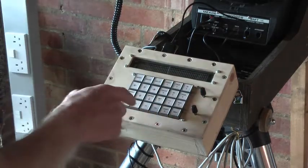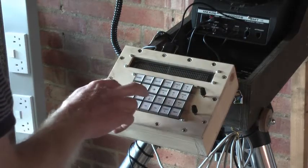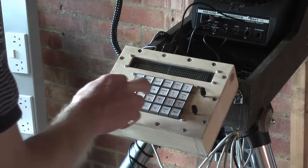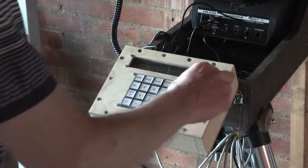We've also used the FPGA on the Pixi to provide a couple of rotary encoders. The rotary encoders replace or add to the menu up-down keys on the keypad, so instead of having to press the menu keys to go up and down through the menus, you can now use the rotary encoders.